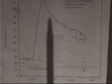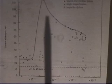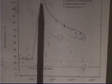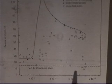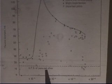And actually, it wasn't adhesive bonding, it was diffusion bonding when I talked about the maraging steel and they put the silver activated layer in between. They got very, very strong joints over 100 KSI, whereas for the silver, in this case cast silver, this is the ultimate tensile strength of the silver.